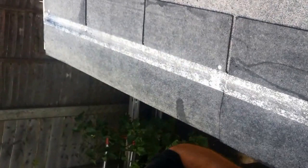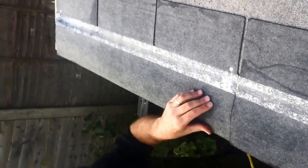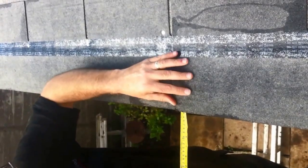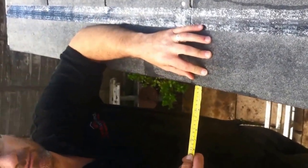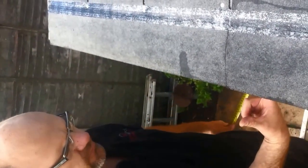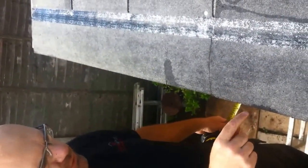We're going to lay these all upside down for the first ones. You might notice that these are just a bit flappy — there's a deliberate reason for that. We're coming 40mm out from the eaves fascia board, and what that does is it allows you to fit guttering so the water runs off the felt shingle tile and straight into the middle of the guttering.